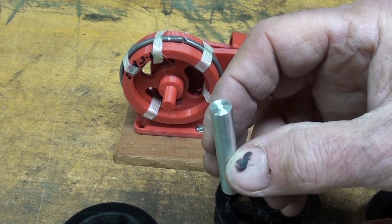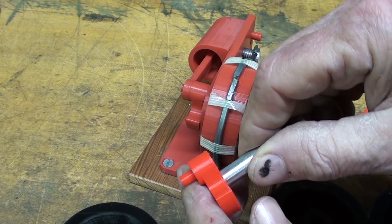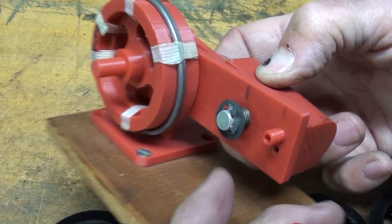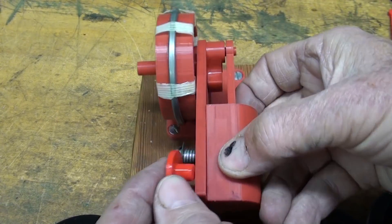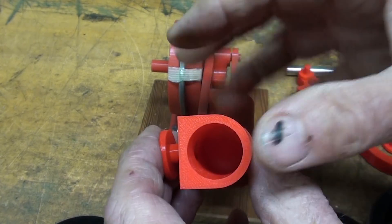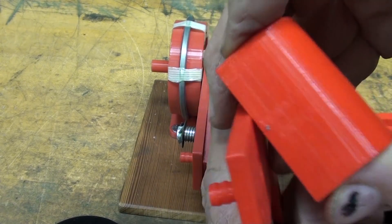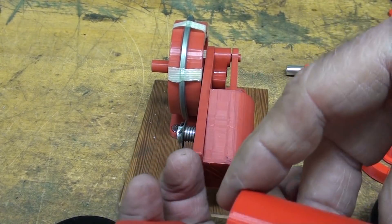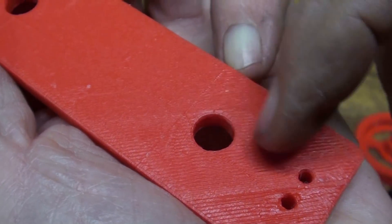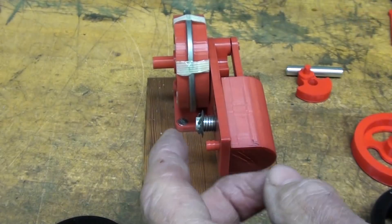My redesign will use this little aluminum crankshaft — it'll go through there and right onto here, and I'll use Loctite to hold that on. The original design used a little peg that went right through the frame and snapped in — it worked better with glue. But in a wobbler engine you need some spring to bring the cylinder against the frame. The 3D print is a relatively rough surface, so there's always going to be some leakage, and that's why I wanted a spring against it.